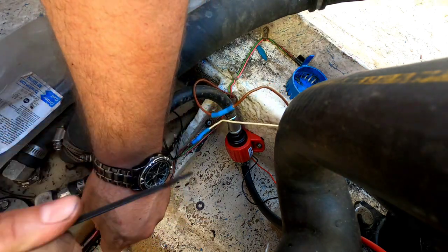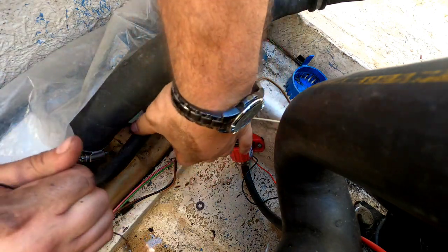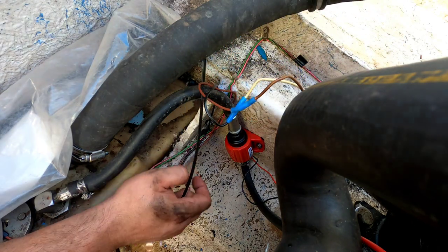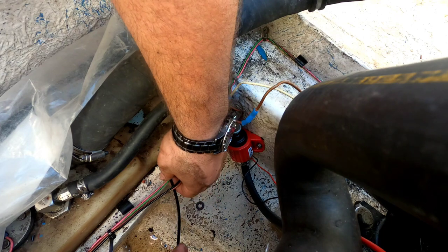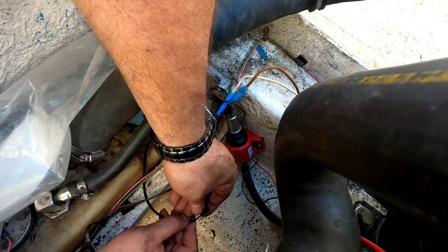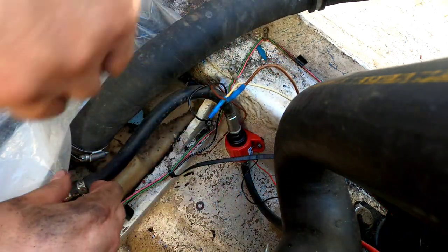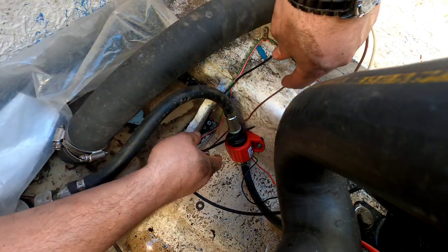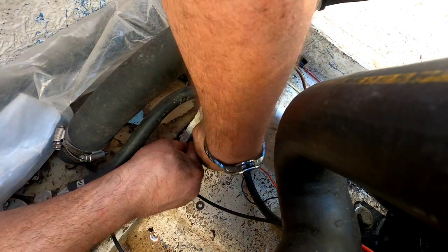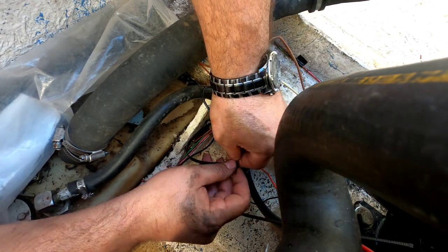Yeah, this motor didn't have a spot for a manual fuel pump, and then I had to change the intake on it because from the original boat motor to this Vortec truck motor, the intake ports are in different spots, so I couldn't just swap an intake. I tried putting the heads off that old motor on this block, and it had the press-in rocker arm studs, and for some reason it pulled the rocker arm studs out of the original heads, so I had to put the heads that were original to this block back on it, and then buy the right intake to go with those heads. But after that,